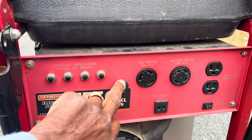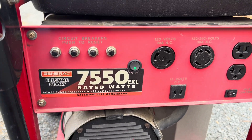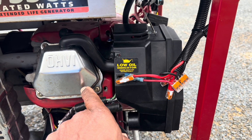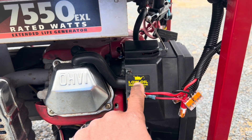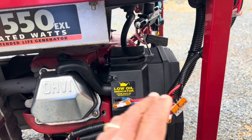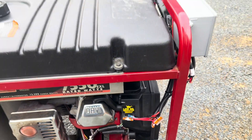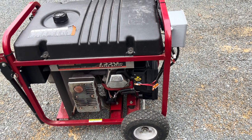You can see I got a switch here - what that switch does is it turns another relay on inside of the panel. That's a four-way relay switch just like the one in front. On most generators is a switch where you can turn it off and on, but what that does when your generator's running is it kills the engine. I wired everything into here off both of them relays into here and took the switch out to kill the power to the engine. We're getting ready to start it up.